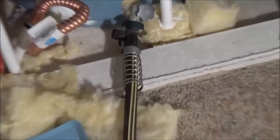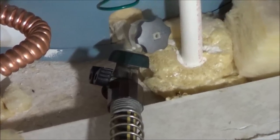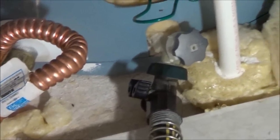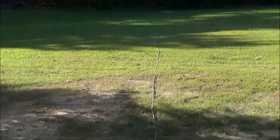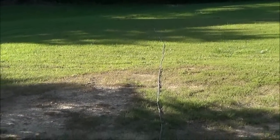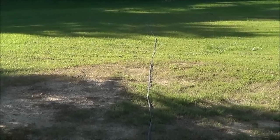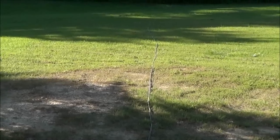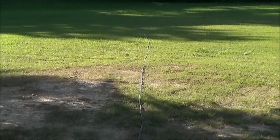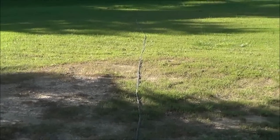Then just hook up your water hose to the drain valve. You may have to use an adapter if you're in tight places like I did here. That's okay. You can have this drain in the basement if you have a sump pump. Next, you want to drag the other end of the water hose out into the yard, keeping the elevation gradually going down to allow gravity to pull the water out of the hot water tank. If your hot water heater is in the basement, you can have it drain into the sump pump, which will then pump the water out.